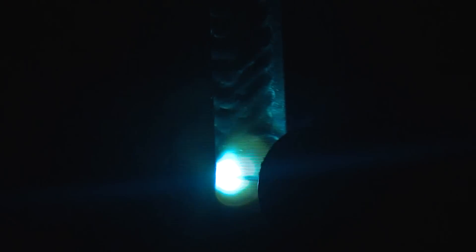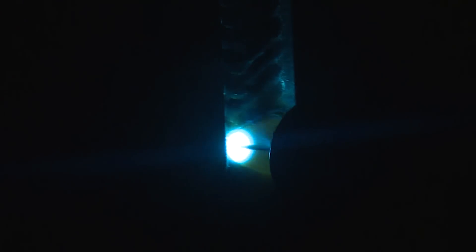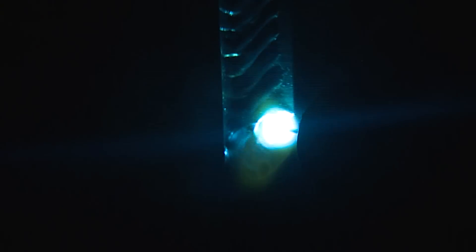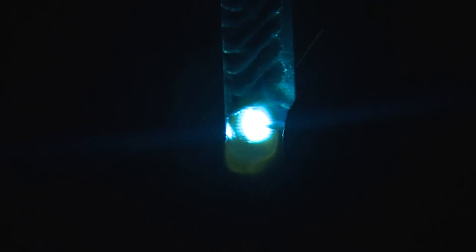I'm trying to keep this wire just over onto the inside of the beveled edge, watching it melt through and fuse the beveled edge away. Right now I'm using kind of a straight side-to-side motion. I'm a little underfill here — not bad.